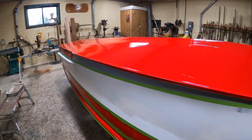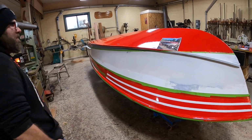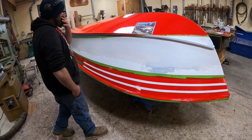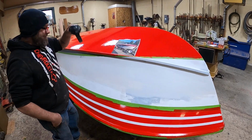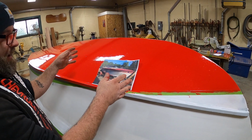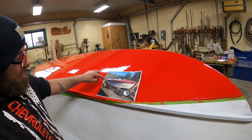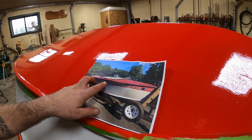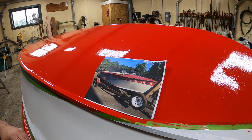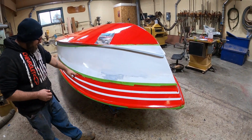The most interesting, well, I'll just hand it over to Joe to talk to you about how he managed, when we had nothing to go by other than a few photographs, how'd you manage to put on the rest of the striping, Joe? So what I did is I actually took a picture that we had that was perfectly to scale, that was straight on, and I broke it all down to scale. So I was able to get a starting measurement from here all the way to the end, how big this stripe was here, how long this Higgins sign or insignia is supposed to be. And then once I figured it all out on paper, I marked on the bow of the boat and on the stern where my 2 lines were for our main stripe here.